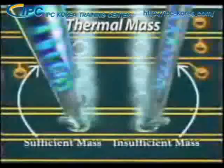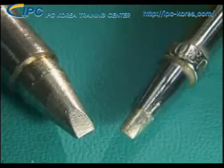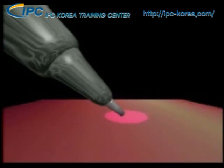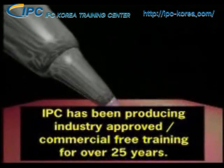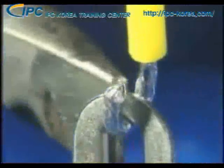The thermal mass of the tip is also important for effective heat transfer. Thermal mass relates to the size of the tip and the amount of heat it can hold. For example, a tip with a weight of one ounce heated to 600 degrees Fahrenheit may be able to heat 7 grams of copper to 600 degrees before the heating element has to energize. A tip with a weight of 3 ounces may be able to heat 21 grams of copper without the heating element energizing, even if the contact areas are identical. This means the soldering operation can be done faster, which is important for connections that dissipate heat quickly and need to be completed as quickly as possible while allowing for adequate solder wetting.